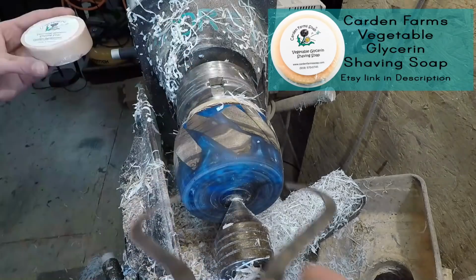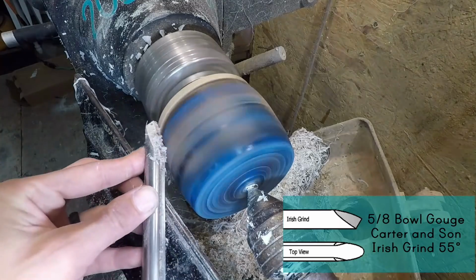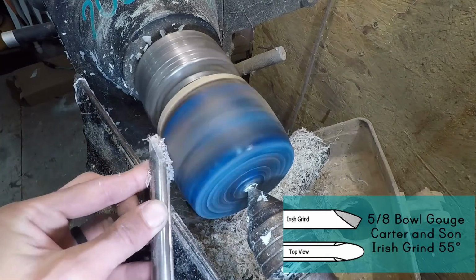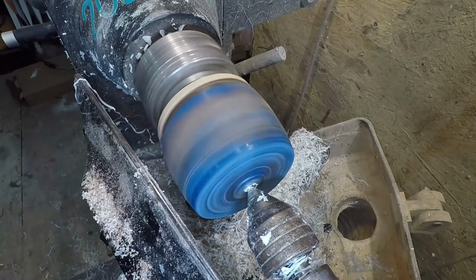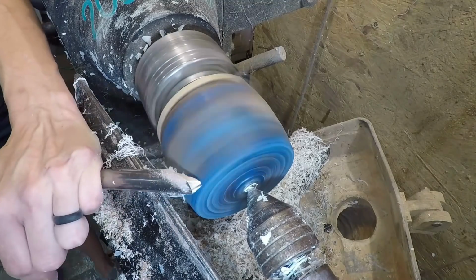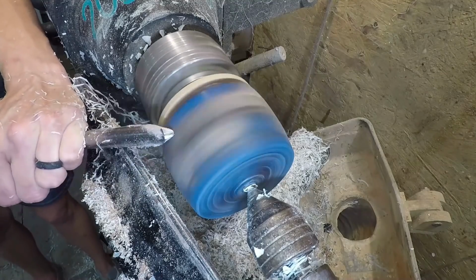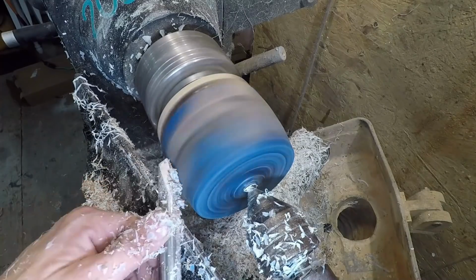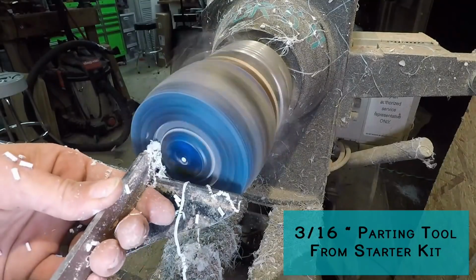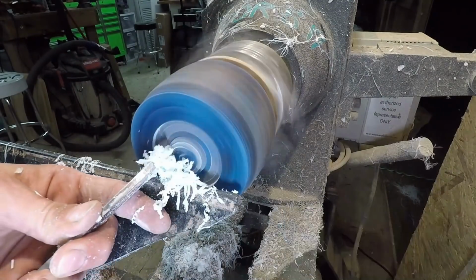It gives room for the soap and the water and everything to seep down to the side of the soap and whatnot. As far as the height of the handle, that is completely up to you and how you want to design them. I try to keep them at the very least 2 inches high. And a lot of times I'll look at what kind of shaving knot I have, and I'll judge by the shaving knot. I don't want things to look out of proportion.